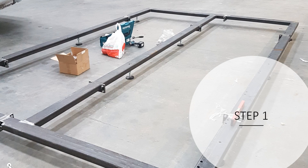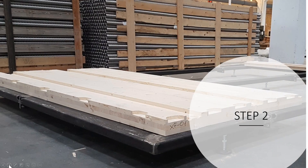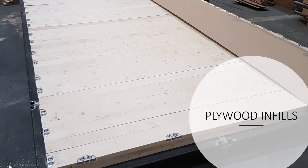Once this is done you'll start laying down the floor panels. The connection between the floor panels is filled with a plywood strip which we also supply as part of the kit. We put paper over the floor once it was assembled just to keep it clean during the assembly process, and we highly suggest you do the same.